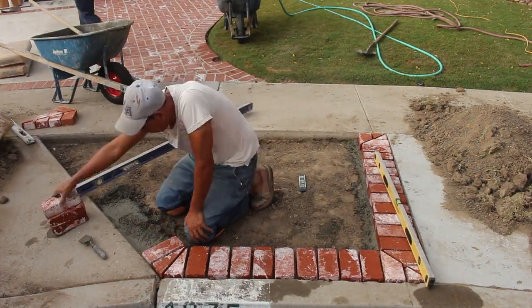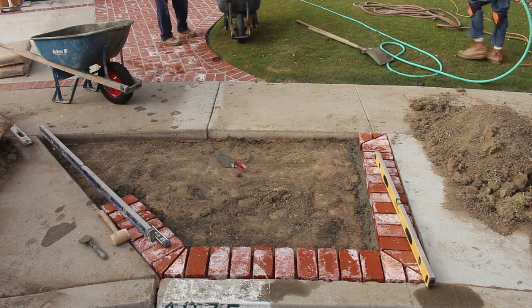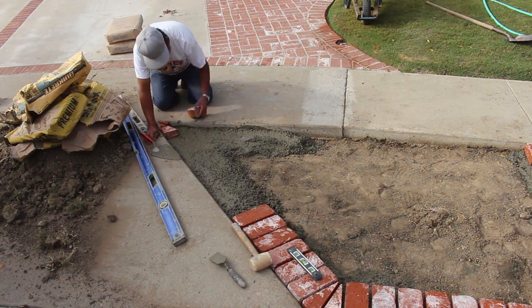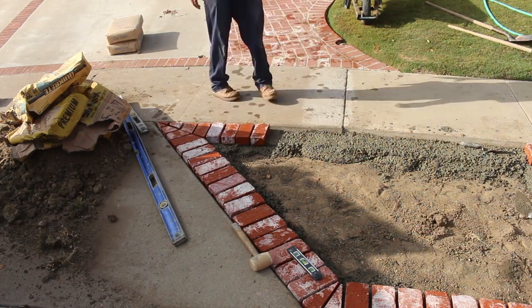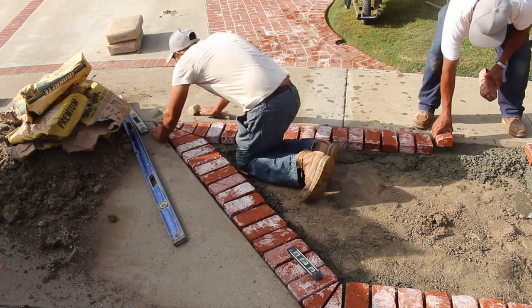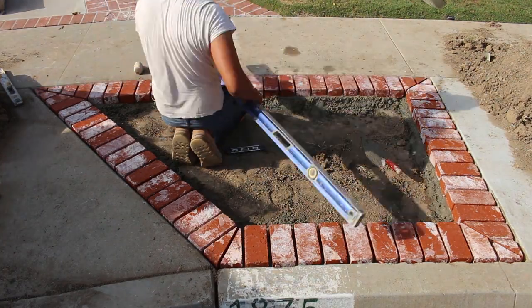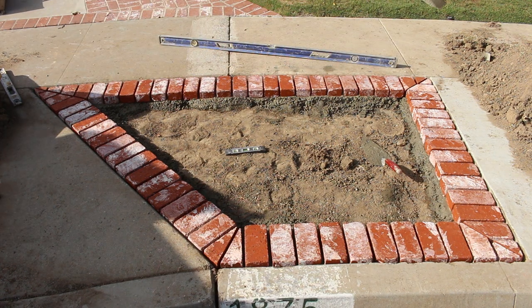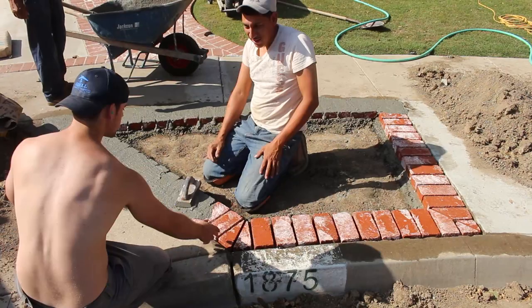To get them level, you just get them close by hand with a rubber mallet. The rubber mallet is good because you're not going to break or damage the brick. Get your base close to the depth of your brick, tap your brick in, then put a straight edge on it from point A to point B and make sure everything is flat. I like to run it on the inside edge occasionally just to make sure they're perfectly straight as well, because a lot of times you're following the edge of the existing concrete and that may not be perfectly straight. If you run your level on a 45-degree angle on the inside edge, you can get them nice and straight.